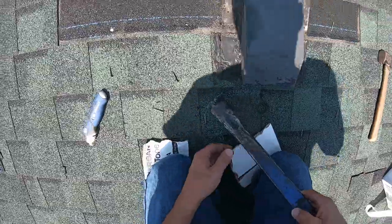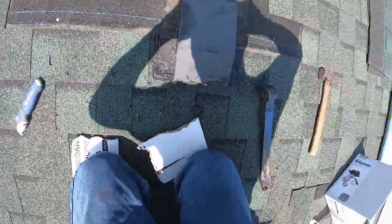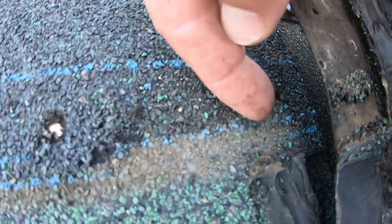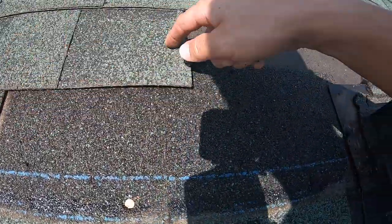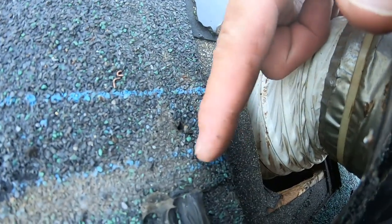Right here looks to be an installation issue. You saw the water trail coming down the side; you see the evidence of it getting in here. See this dirty water trail? Look at the edge of the flange — see how big and sloppy this shingle cut is? It should be closer over here. You've got water pouring off and just trickling in. Same concept as your pattern, your stagger — you want these offset. My guess is it's trickling in right off of this right here.